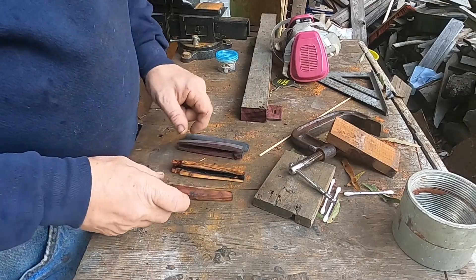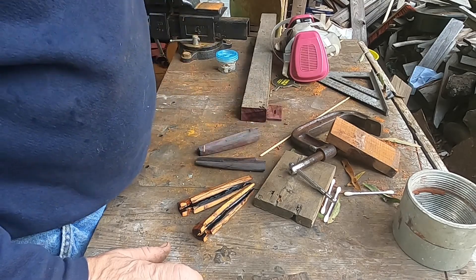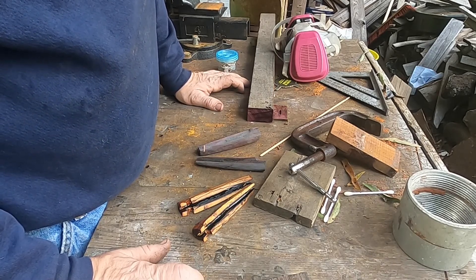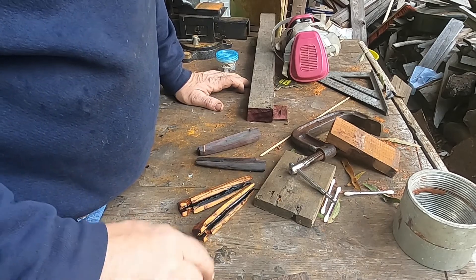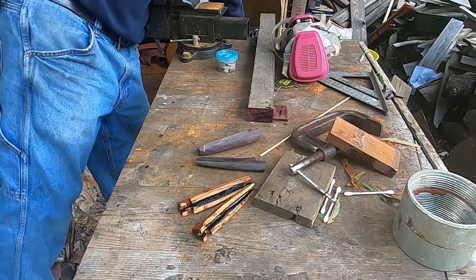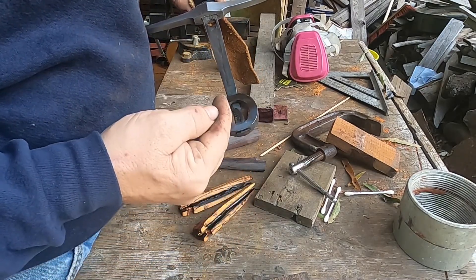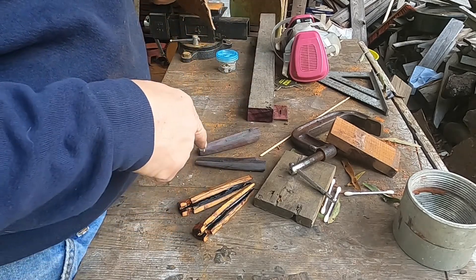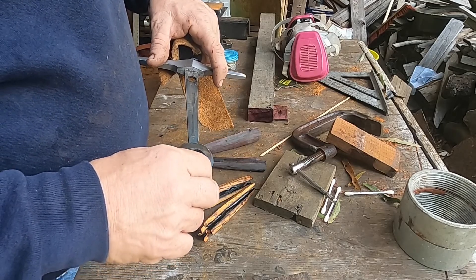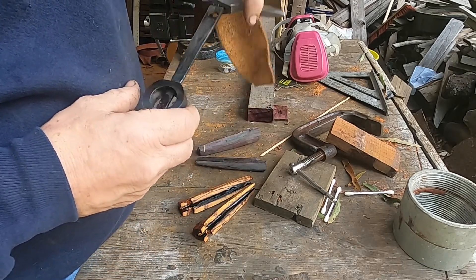So these are two of the three. If I'm being completely honest right now, I'm just trying to get this blade done. I'm over it. Yes, there is a lot of frustration right here — I'm not even going to try to hide that. But out of curiosity, how many of you mentioned in the comments realized I was messing up before I realized I was messing up? What I should have done was created a step here to drive the pommel into onto the tang rather than driving it onto the wood. Wood is a lot softer than steel and something's going to give — and it's going to be the wood. And as you saw, it gave. So now I've got a lot of cleanup to do because of my mistakes here.